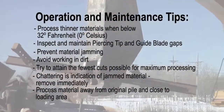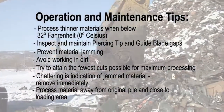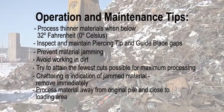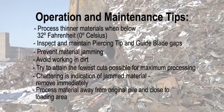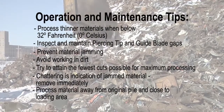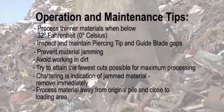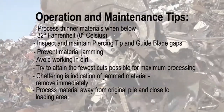It also helps to give yourself enough room to keep out of the way of other personnel and machines. Material should be picked from a pile, swung to the side, and cut in a new area. This prevents redundant cutting of the same pieces and allows the newly prepared material to be loaded out with another material handling machine. Material processing areas should be as close as safely possible to the location for loading materials for transportation.